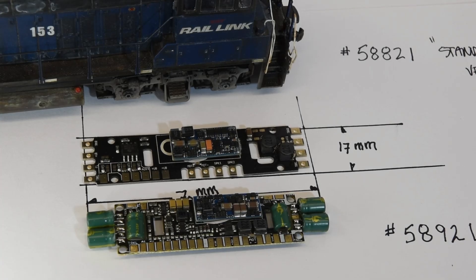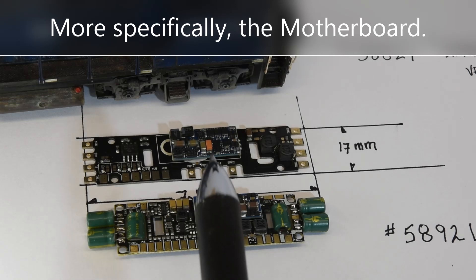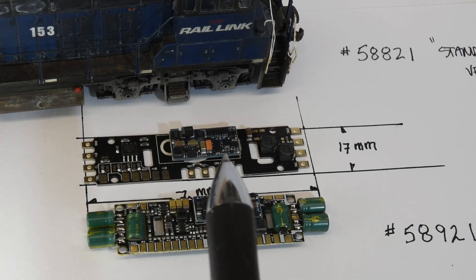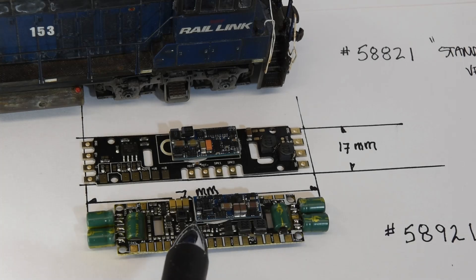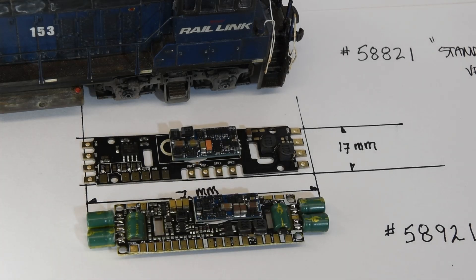So I want to show you what I'm impressed with on this new decoder, which is number 58921 Integrated Power Pack Generic. If not the best decoder and motherboard on the market, arguably. Now they've upped their game with this new version — it's quite different in a lot of ways. There's been some significant changes. Number one is the six additional capacitors they've added for the Keep Alive feature, which I find impressive. The TCS one I have has four — maybe they're larger capacity, I'm not sure yet.